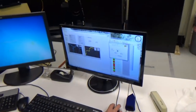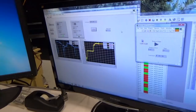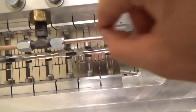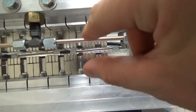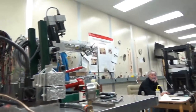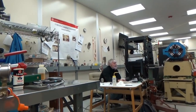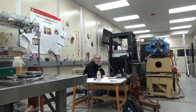Here we have the controls to move this array. Why do we need to move this array? Basically, the gap between the upper and lower arrays needs to be adjusted. And what does that control? The X-ray spectrum — so X-ray energy, the energy of the photons.